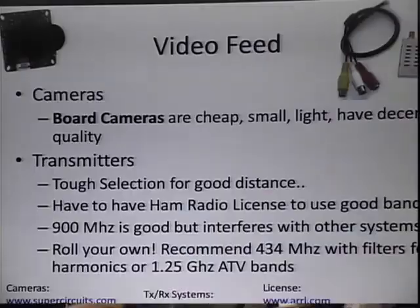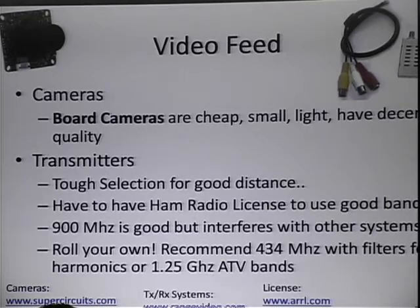Transmitters are more of a problem with these setups. You really have to have a ham radio license to do anything in the RF bands legally. The regular civilian bands that are opened up, if you don't have an FCC license, kind of stink for video feeds, because anybody and their grandmother can have a little security camera outside transmitting wirelessly, and that's really going to mess up your video feed, especially when you go three miles over the hill.